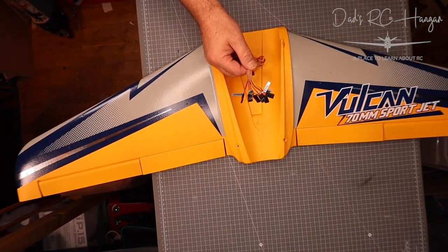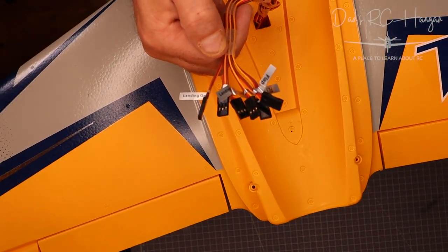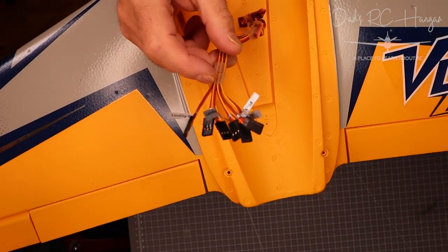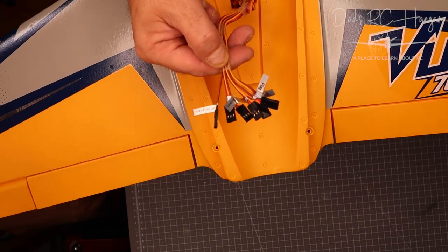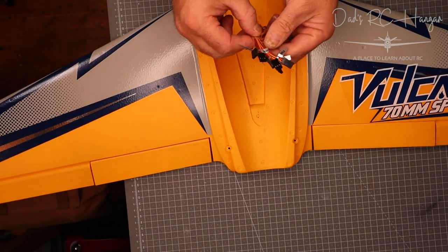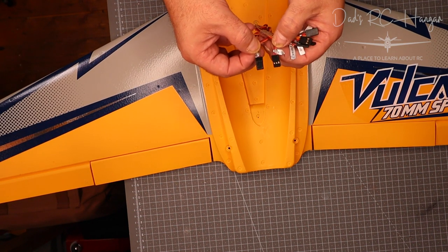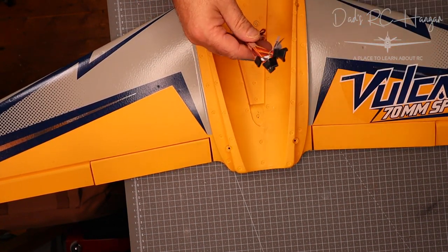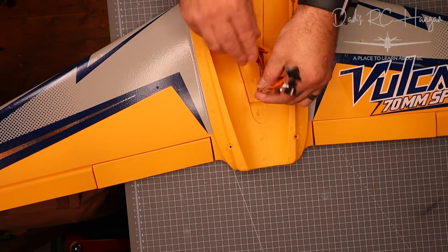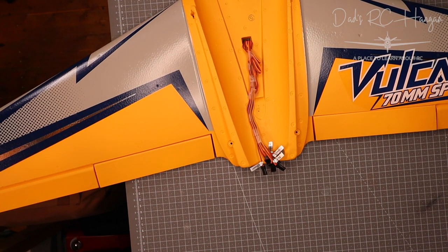I've done the signal and minus alternating. The reason I've done that is because you've got a couple of landing gear, and then in the blue box you'll have one to the left and one to the right of the box. Rather than trying to twist them around and have them all over the place, I've made them nice and neat — a wire loom that literally fits up into the fuselage. I just hate messy wires.